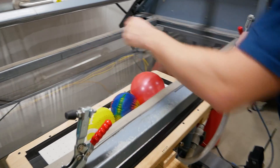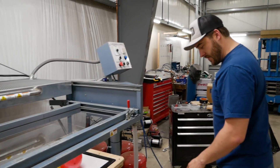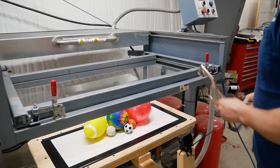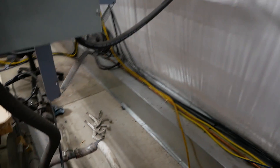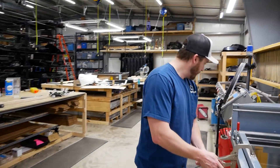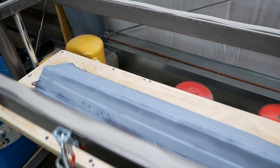You've got to step up everything behind the vacuum former too — it doesn't want to pull out, it does a pretty good job of holding things in place. When you supercharge your vacuum former you've got to step up everything behind it, and we also clamp it down because the little clamps don't hold very well for what we're doing. Usually these vacuum formers run off one charge tank of full vacuum — our small one runs four tanks, the big one runs six. We've got valves on there so we can turn those on and off. We've got some power.